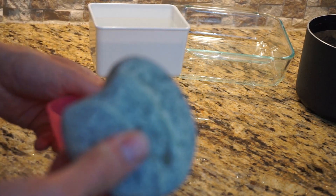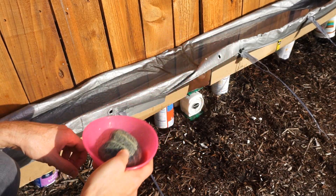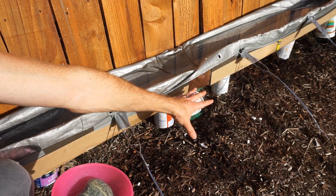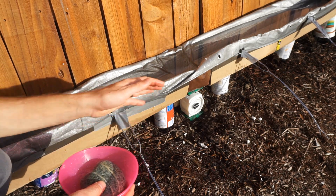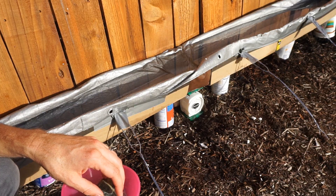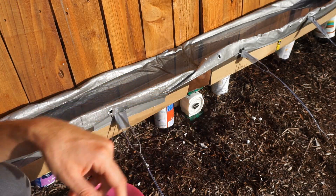So now back to our boat experiment. Where does the displaced water go? The water gets displaced and placed evenly throughout the entire length of your waterway — it raises the water level across the whole river ever so slightly. So the only weight the bridge feels when you place a boat in it is a very minuscule amount of water rising a negligible amount. When you build a water bridge, you only have to design for the small amount of water it needs to hold — you could put any amount of weight on a boat crossing it and the bridge won't have to bear any additional load beyond the water itself.